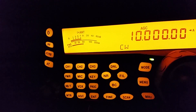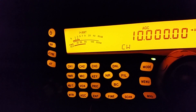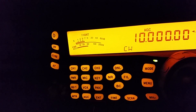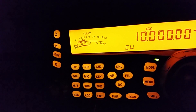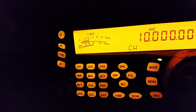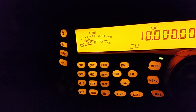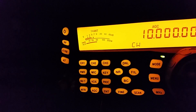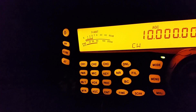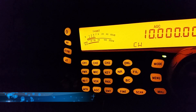The first one we're on at the moment is a stock whip that's 32 inches, about 82-83 centimeters. The next one we're going to use is a 1.95 meter long one, roughly about 64 inches. This is the stock whip that comes with the antenna and we're listening to WWV on 10 megahertz. It's around S5, a little bit of QSB at the moment because we're coming down off a class M4 geomagnetic storm that happened earlier in the week.